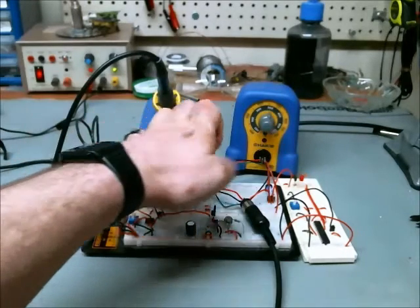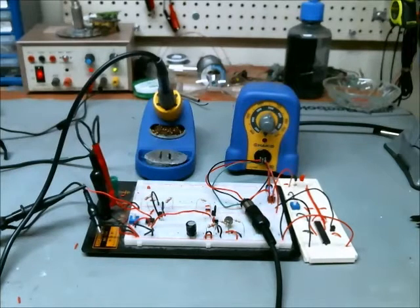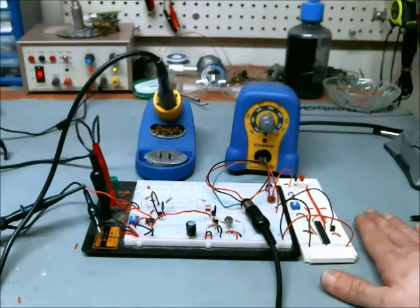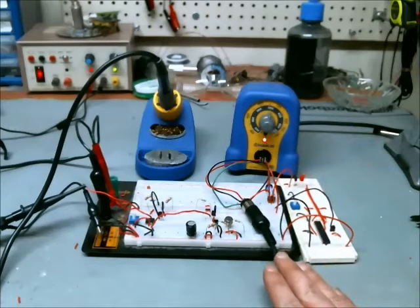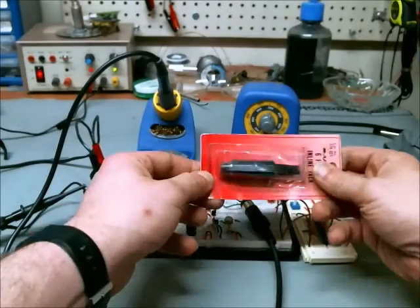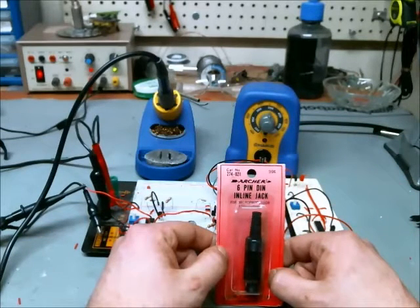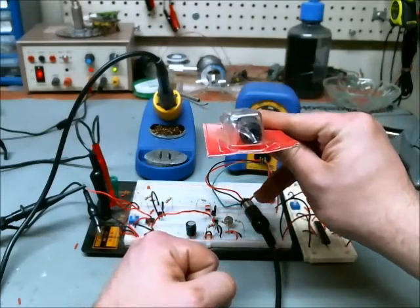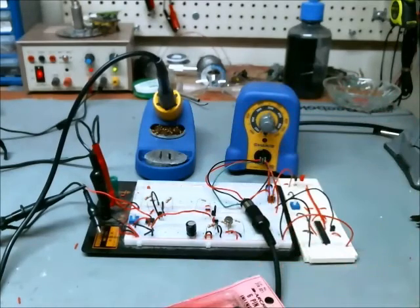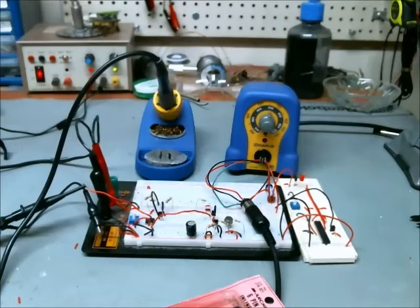Thanks for watching — my next video will be compiling this into a much smaller enclosure and circuit board. Some final notes: I intentionally kept the delay short just for the sake of time. For the connector I used to connect to the Hakko FX888, I used some old-school Commodore connections — this was from Radio Shack originally, catalog number 274-021. I'll try to find a link and put it underneath the video so you can find that part yourself. You'd need a female and a male connection so you can put your inline relay in place.